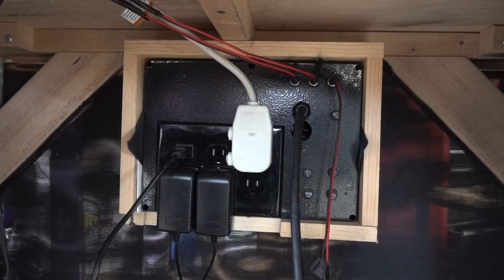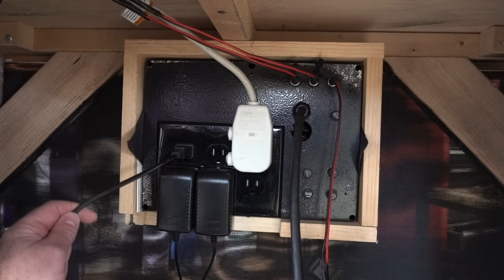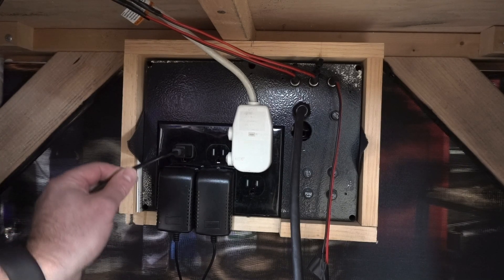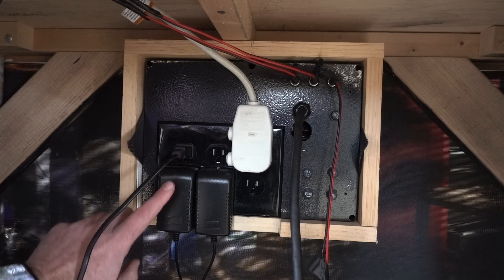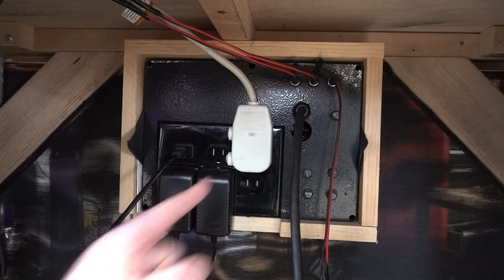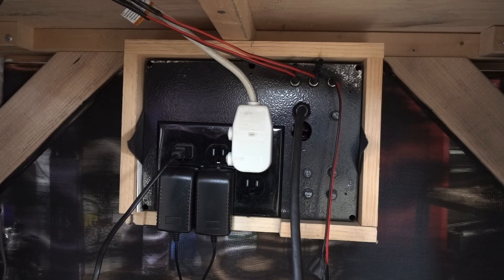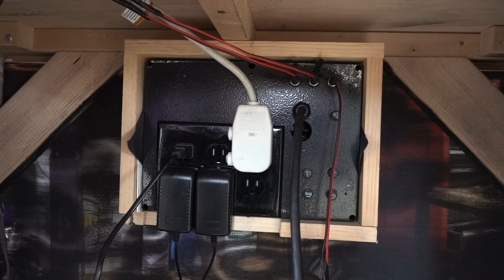Here's a look behind the control panel installed on the glycol cart. You can see I installed six outlets — each outlet controls either a heater, a pump, or the AC unit. For the first fermenter, the top outlet powers heating and the bottom outlet powers cooling. The second set of outlets controls the second fermenter, and the third set controls the AC unit — when the glycol needs to be cooled, the temperature controller turns on the top outlet and the AC unit turns on.